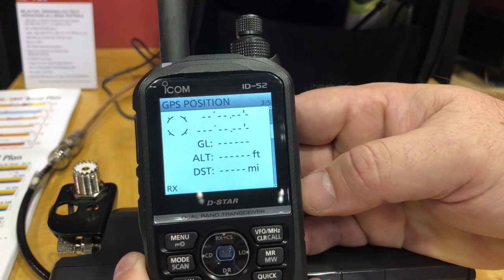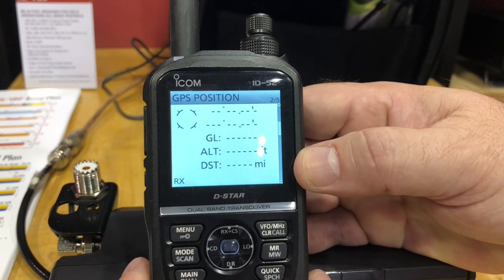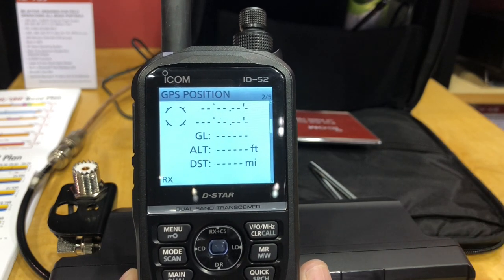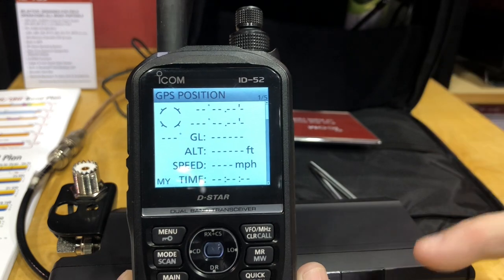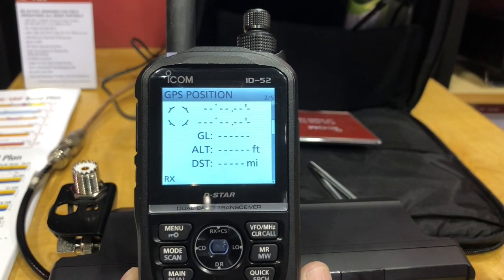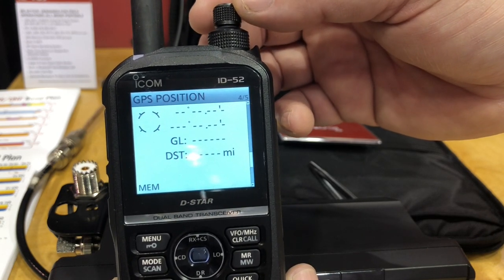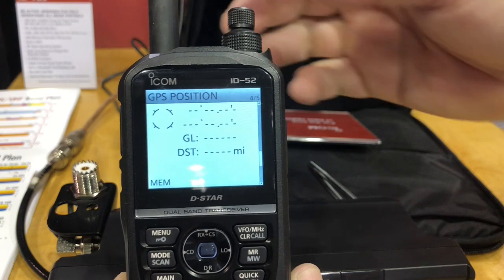Because everyone asks — is this going to do APRS? No, it's not. It supports DPRS, and the advantage of that is voice and GPS simultaneously on the same frequency. With APRS, you have to be on one of the APRS node frequencies on one band, then talk on another. With DPRS, it's all together. You can easily see what your location is, a received signal, the compass rose — as you're hearing them talk, you can see how far away, what direction, the distance, their speed. You can put locations into a memory mode — waypoints, like in the marine industry — so you can navigate back to them.